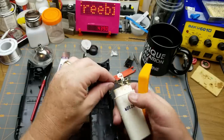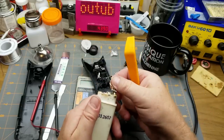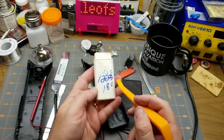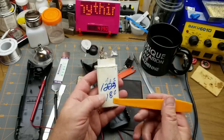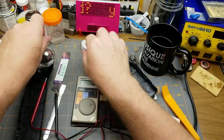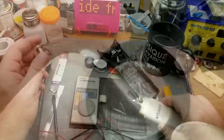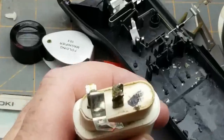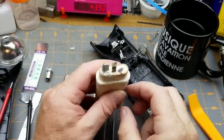Let's see if we can lift it out — being super gentle of course. That terminal just cracked right off, and there's the other terminal soldered on. There's some markings on it I can't quite make out. There's corrosion and crud everywhere. What does the bulb say its voltage is? 2.0 volts, 1.2 amps. And what does it say in there on the battery? I think I can see some lettering — lead acid battery. So it isn't a NiCad as I initially thought; it's a sealed lead acid battery.